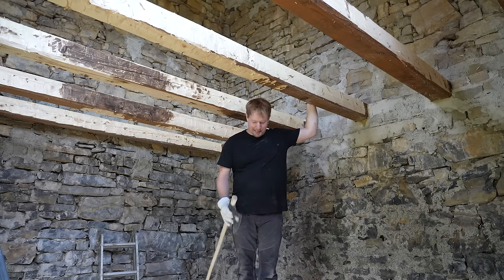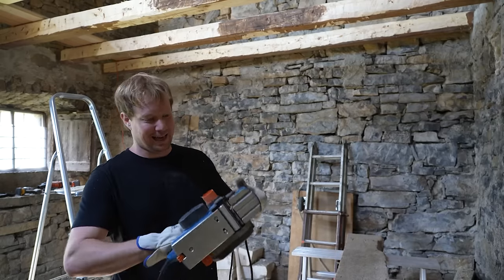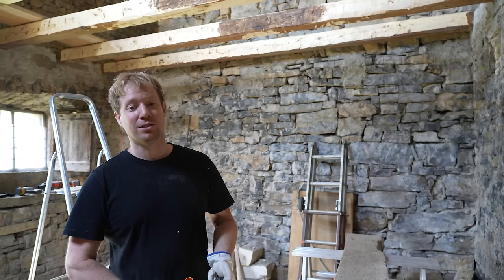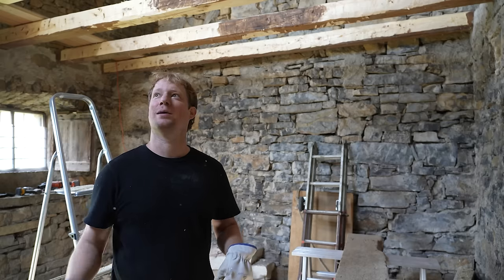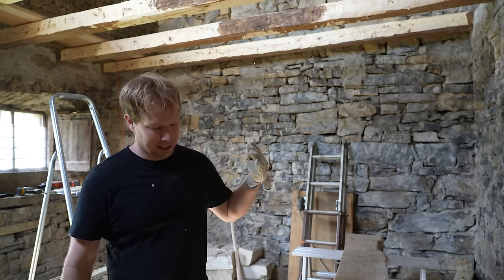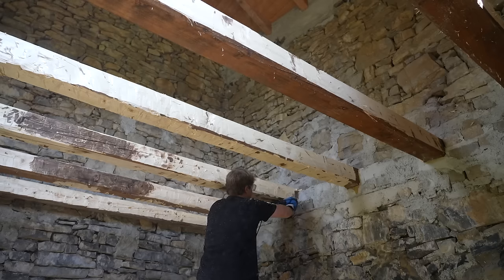So I took last night to think about it and I found a different solution. I went and picked up the cheapest planer that I could find, and then I more or less destroyed the blade intentionally so that instead of smoothing out the wood, it would chip it up and eat it up and cause it to be distressed. And if I push the planer against the grain rather than with the grain, it does a rather nice job at eating up the wood.